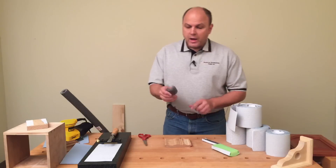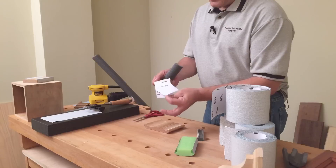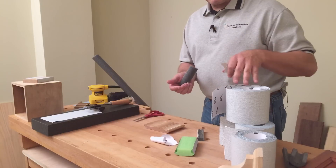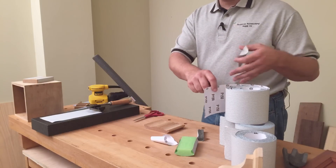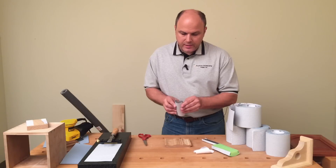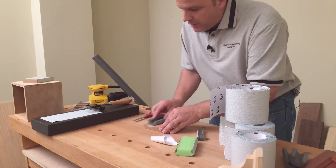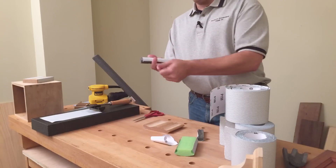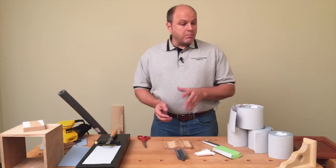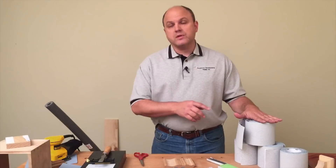To do this longer shape, I've cut one and split it in half. We peel back the corner — and that's the beauty of this type of material, it's a peel-and-stick backing, which means I don't have to worry about sawdust getting on here and ruining the adhesion. It's protected until I'm ready for it. I'm going to place that right on top, push it down. You can see I've got that nice curved shape now, and that's going to allow me to sand that profile without it wearing on my hands. Whether you're working on molding, raised panel doors, drawer boxes, or sharpening, you're going to find multiple uses for this type of material in your shop.